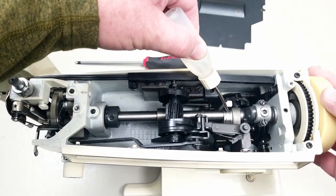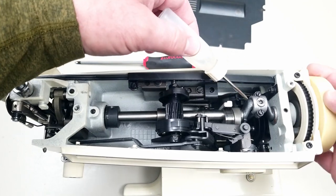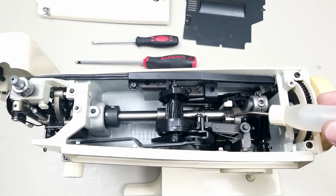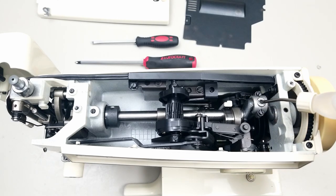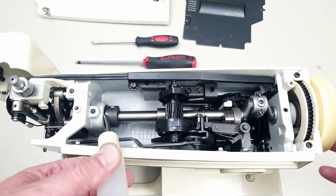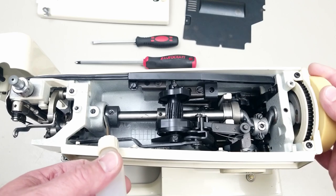If you're not going to take all the covers off, I wouldn't recommend that because you just blow the lint and dirt deeper into the machine where you don't want it. So basically, important areas are this shaft right here that's rotating on this fork. This shaft — you can actually see an oiling spot there. There's one right here where the shaft goes into the casting. I always hit this one here. This is just like a locking collar to keep the shaft in the right position.